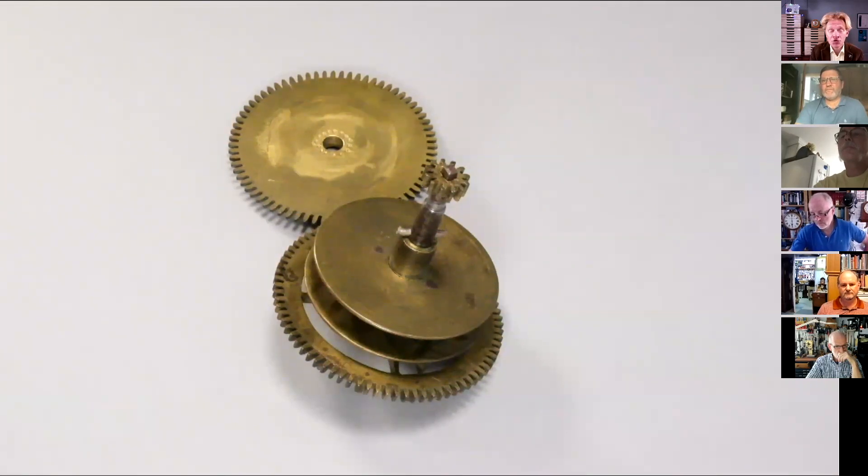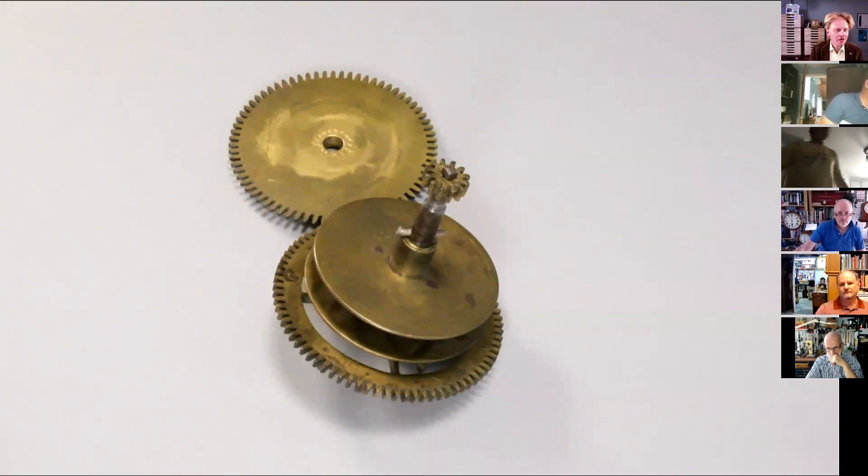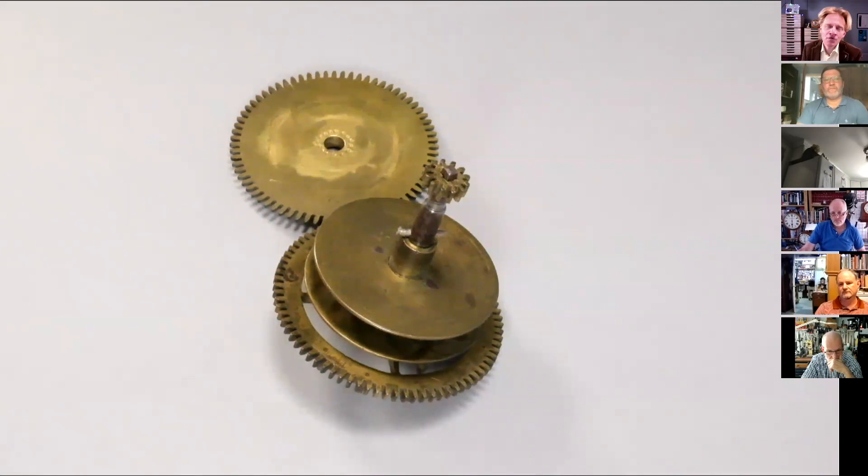One of the things that happened during the week was our live stream on Thursday. We were on a medium-term project working through a late 18th, early 19th century European long case clock or tall case clock movement. We got the going train ticking - we've gone through the going train, repivoted, refinished, refaced one of the pallets. Really pleased because we managed to do it with minimal cleaning so far, no pivot polishing and no bushing either. Back to the striking train next week and we'll be doing a bit more silver soldering.